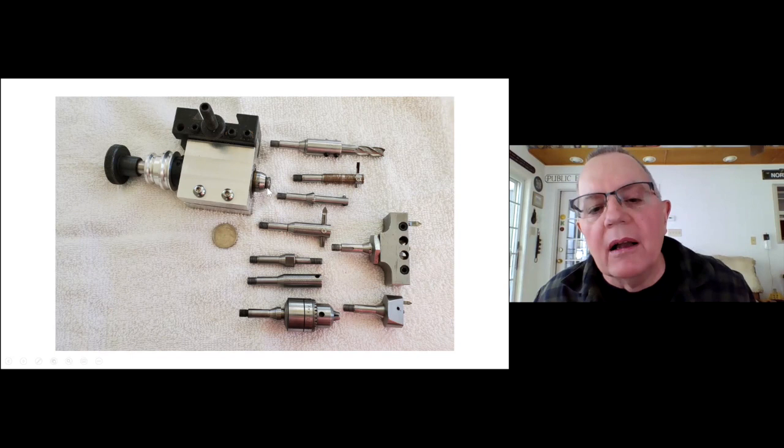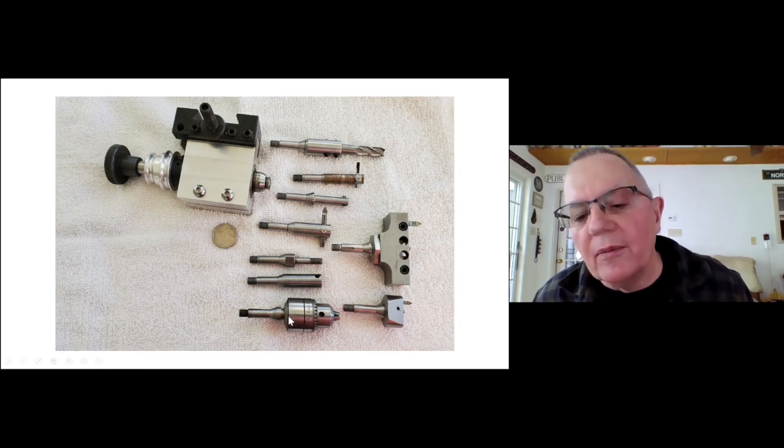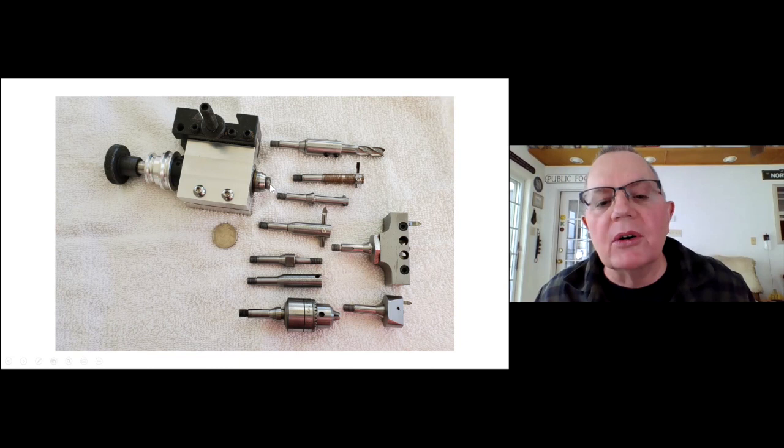And then this, I wanted to show right here. This is a collet from a watchmaker's lathe. So that would hold tools in a watchmaker's lathe. And it has a 1/4 for reference. This right here is a blank that a guy made. So I took some of those and modified them to be able to use them for different tools. Holds end mills, fly cutters, eccentric cutter. And this again is a drilling frame off a Rose engine, so it really becomes a multiple use tool.